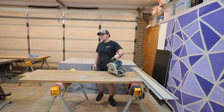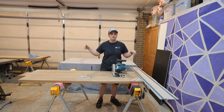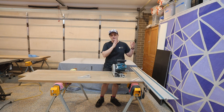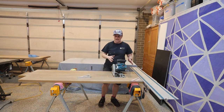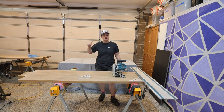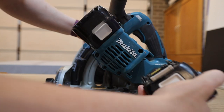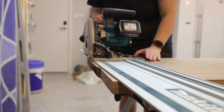To cut the end square I'm going to use my new track saw. I have to be really careful because I do not have a lot of room to play to trim them to length, so I'm going to trim the least amount I can off this end. I need to cut them to 1800mm long. The track saw is a new addition to the workshop and it's working out great. Being battery powered means it's quick and easy on the setup and I can take the saw right to the workpiece.